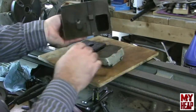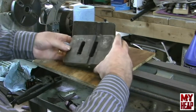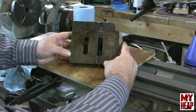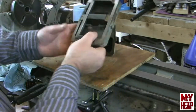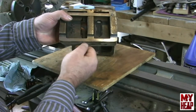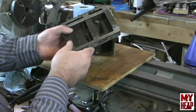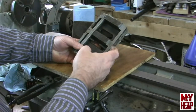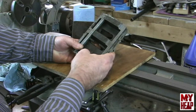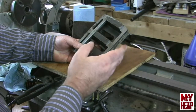Mine is fairly rusty and pretty gunked up, both the top casting and the bottom casting. So I'm glad I took mine apart just so I can get this cleaned up and get the crud out of there and get some fresh oil in there. Another thing I noticed — man, that is bent. So I'm going to need to fashion some sort of new long set screw for that. Instead of slotted screws, maybe cap head socket — long socket set screws or some long square head set screws, preferably 3/8ths because most everything on the lathe is 3/8ths.